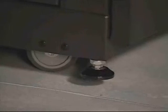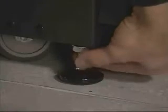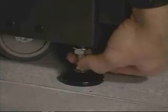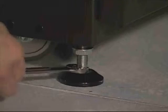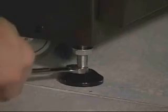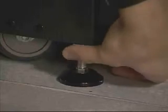For single rack installation, it's important that the rack be stabilized before component installation. The leveling feet, located beside each caster, unscrew and extend to the floor, compensating for uneven surfaces. After positioning the rack in its final location, extend the leveling feet until the weight of the rack is fully on the feet and off the casters.